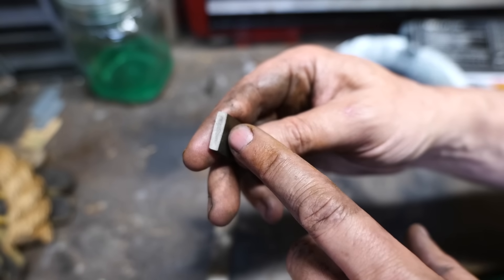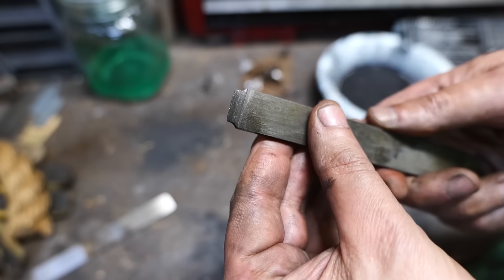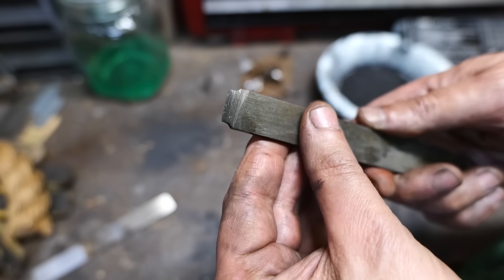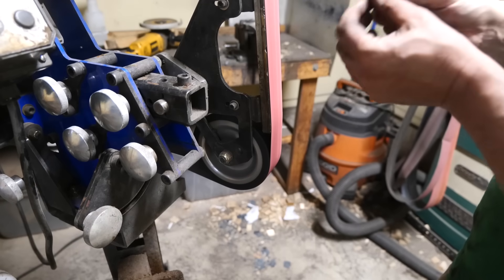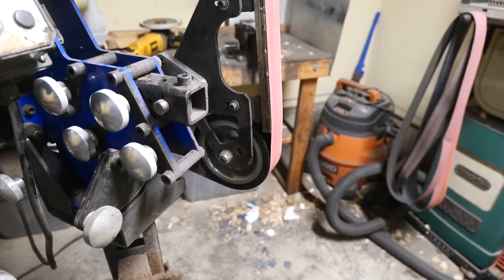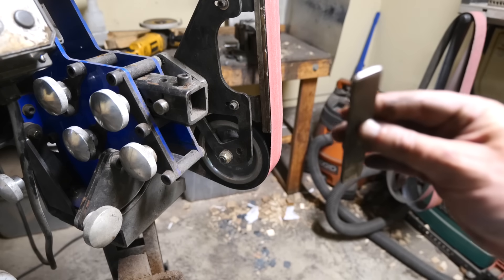Oh my god. So I've ground all the way around to the interior dark-etching core and I'm going to spark test it. The outer layer doesn't look like high carbon steel — it looks like it has too much carbon, like it's maybe cast iron. I can't make a knife out of that. But the core is sparking great — that sparks like high carbon steel. So I think there's excess carbon around the outside, and that core is what we need.